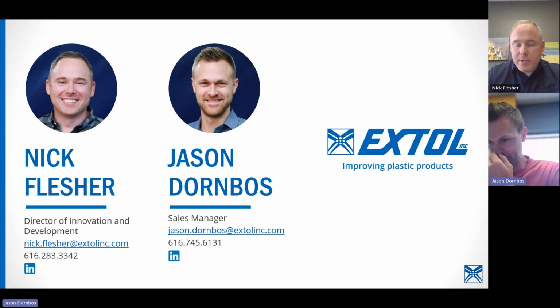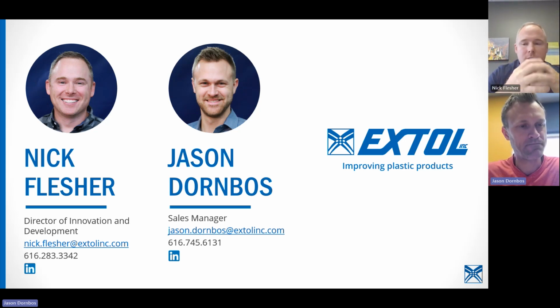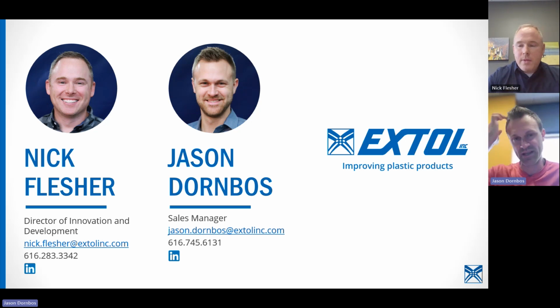Stephen asked also about 3D printing materials. The tricky part with that is you have to have transmissive properties, and most of the 3D printing folks don't care about that. For example, we do HP Multi Jet Fusion, which is a really next level in 3D printing. It has an IR absorbent inherent in it. I think on our cover page we did a laser cut transmissive component for that. So it's tricky to use 3D printing, obviously. The absorptive can be 3D printed, but the transmissive usually can't.